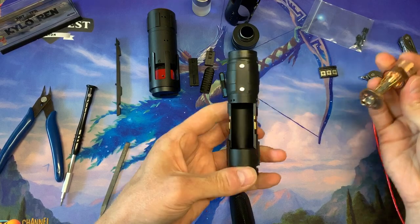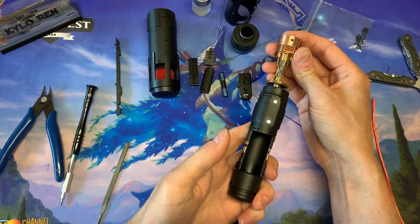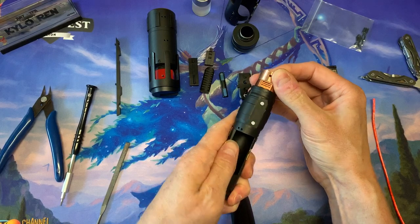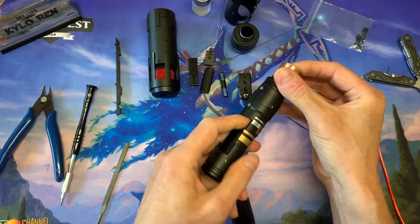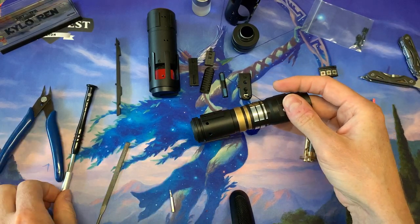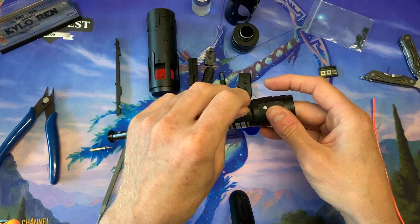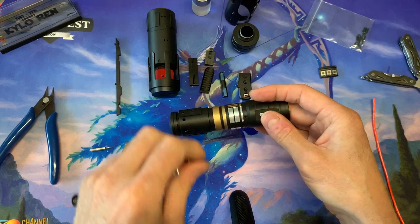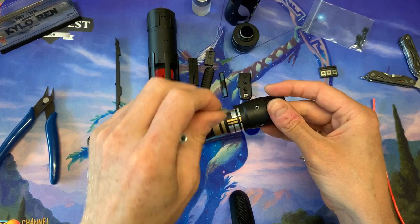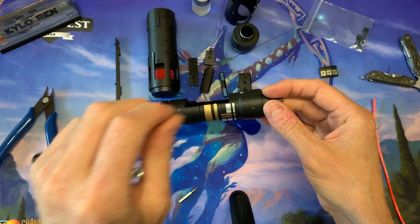Adding your chamber is very simple — this slotted area is basically facing you. Hold it flat and then just slide it in. There may be a little roughness to the slide-in; check if any screws are pushing down. For instance, this set screw looks to be a little bit engaged — this is the 1.5 millimeter. Also notice you have your blade retention — this hole itself is an M4, this hole is an M3. These are all using metric sizes.